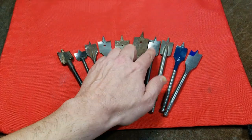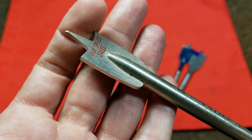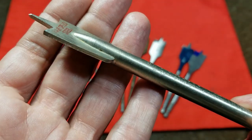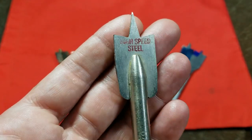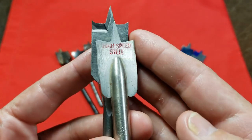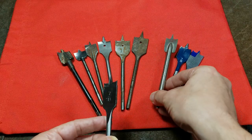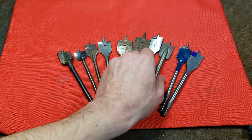I initially thought it was just the same as this bit, but it is actually pretty different. We have an old Miller's Falls version here, and this one's pretty nice because the cutting bit is actually a piece of high-speed steel. The rest of these are going to be some form of tool steel or carbon steel, and then they use this extra thick shank that it's been brazed to. As far as material quality, these are some of the very best old spade bits. Their modification has this deep slant so that each of these corners are engaging a little bit sooner, perhaps an early version of the spike approach, to further help improve the finish quality. This is only one of these Miller's Falls I've ever seen, but I thought that was pretty impressive — a high-speed steel spade bit.